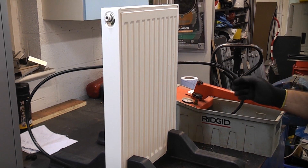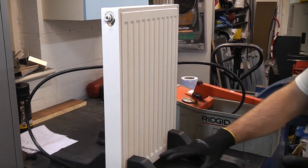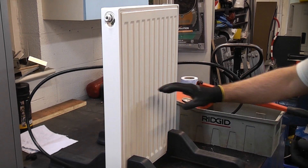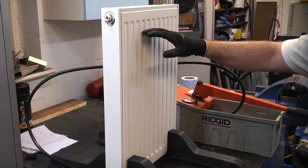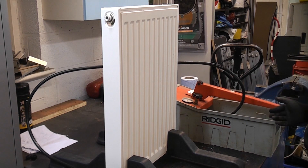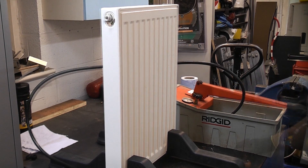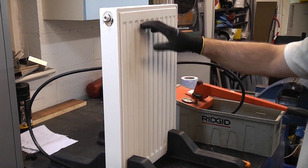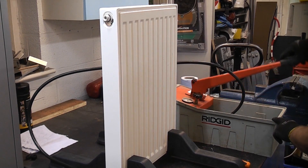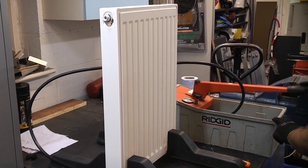I've now rigged this up to demonstrate exactly what happens normally in a central heating system. The water will be pumped around the system and if there is air trapped in there it can't transfer the heat correctly to the top of the radiator. I'm going to use this pressure testing rig — normally in domestic heating the pressure is approximately one bar. At the moment we have a small amount of water in there but it's not right up to the top, so if I try to pressurise it all we're going to do is compress the air at the top of the radiator.